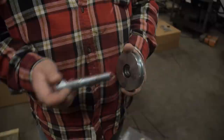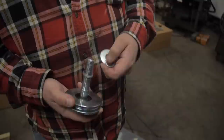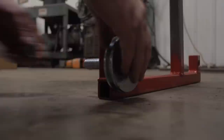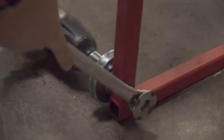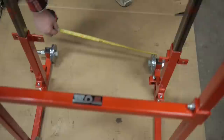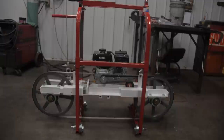Installing the track wheels: using a large shoulder bolt, two spacer washers, and a large washer. A large flat washer will be against the frame; the wheels will be on the inside of the mill frame. Once bolts are through the frame, add nylock nut and tighten. Measure wheels so they are 20 and 3/4 inches center to center. If it does not measure 20 and 3/4 inches, reference the end of the video for further instructions. This will complete the inner head assembly.